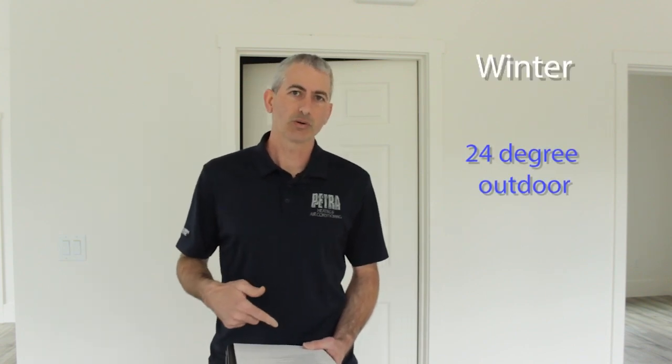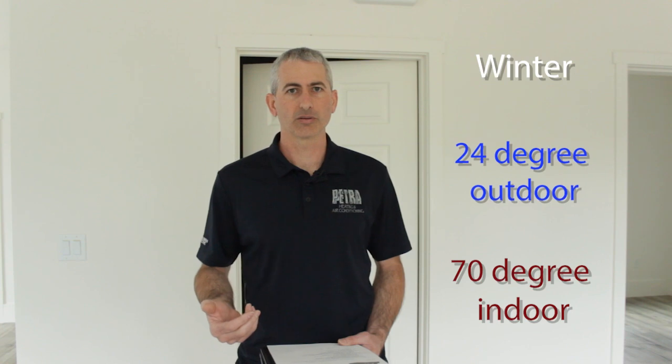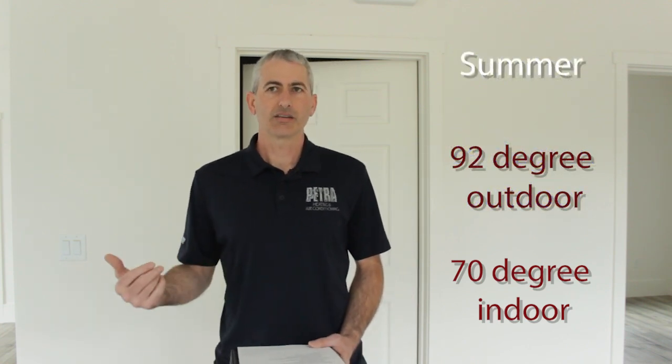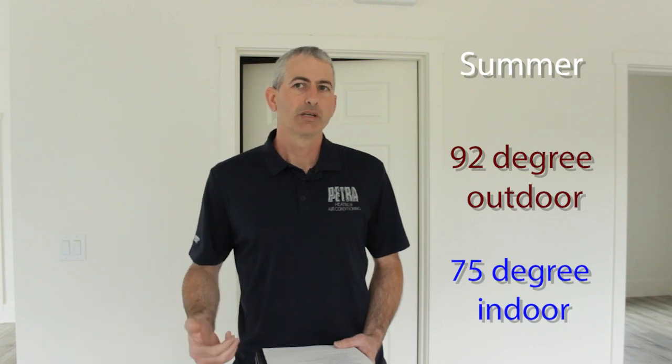So in our climate, we designed for a 24 degree outdoor with a 70 indoor for winter. In summer, it's 92 outdoor and 75 indoor. So those are our design parameters. Anytime we have extreme weather that gets outside of that, like our ice storm we just had back in January, these systems can have a tough time trying to keep up in that weather.